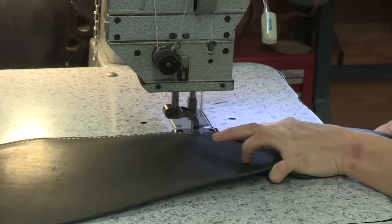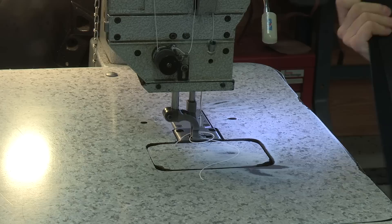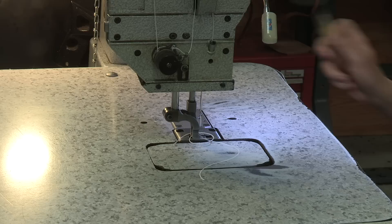That's one of the key elements — in the old days they used to do collars with chain stitch, like feed sacks. And that's terrible, because once it goes, the whole thing goes. So these stitches are a lock stitch, so every stitch is locked in. You break a stitch, the rest of them stay.